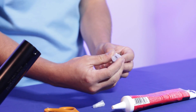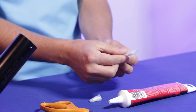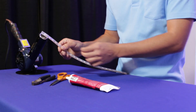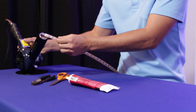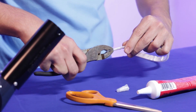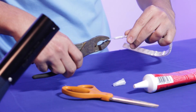Once you've done that, you'll see it's blocking off the end. Now to make sure it stays on, get your heat shrink tubing and slide it over, letting maybe half an inch hang off. Once it's completely around the whole piece of the strip and you've got your silicone in there, get your heat gun and apply heat. Before it cools off, get your pliers and squeeze it. When you squeeze it while it's hot it actually sticks to itself and creates a really nice tight seal.